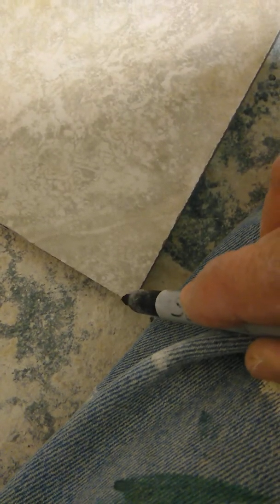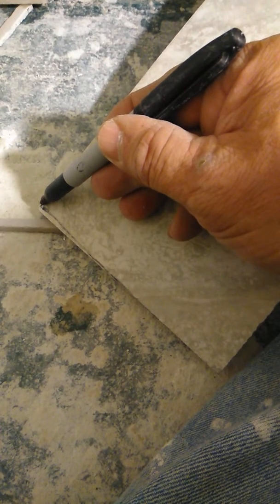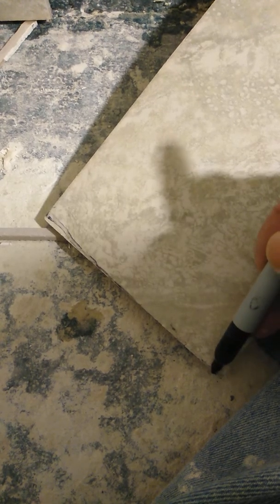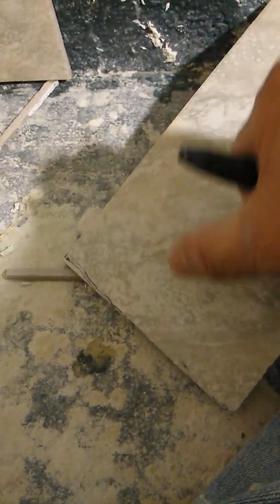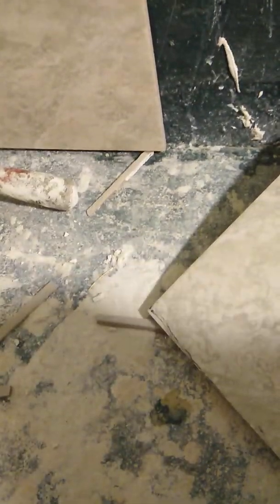this outside corner of the tile at the bottom, which I call nothing because we're cutting it to the face of the tile at the end here. So I'll cut it from here and it will gradually taper off to the outer edge here, and nothing will be taken from this corner. The blade should slide right along this last part of this tile on the edge. It should just slide right along it and you know you've got a nice cut. All right. We're going to have to pause it, do the cut, and come back.